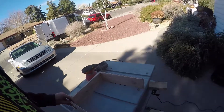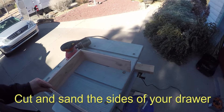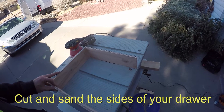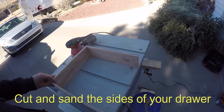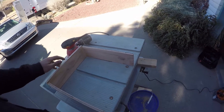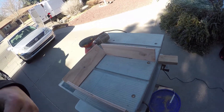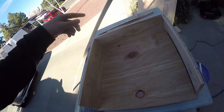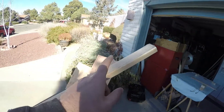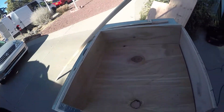I've cut and sanded my drawer — this is the general idea. This will be the back. Now I measure out and cut a base for it, and then I'll do posts on all four sides. I cut it — this is my base here — and now I'm going to cut pieces out of this to go in all four corners, just to hold it all together.